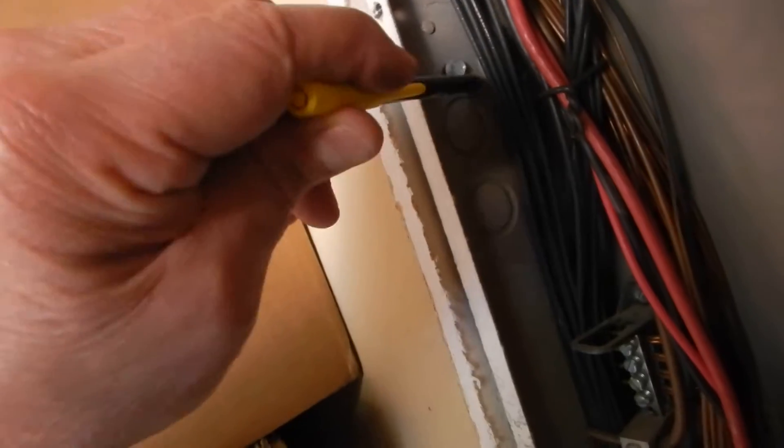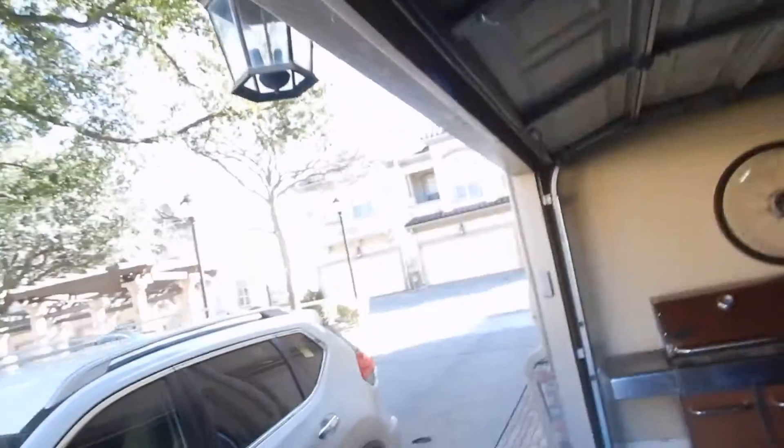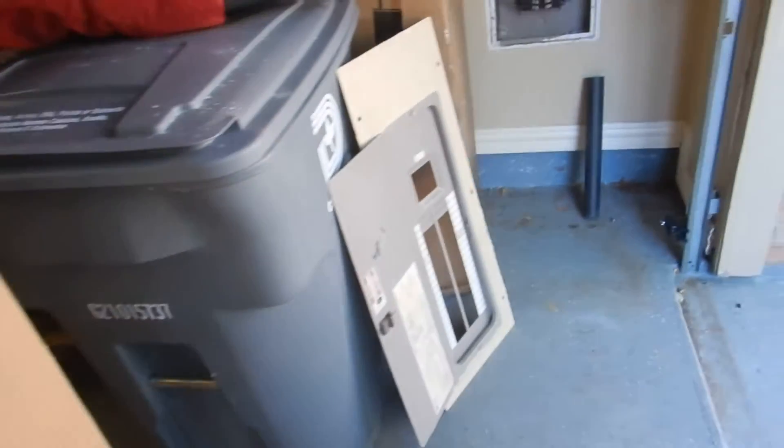The cabinet was screwed in. Screws are faster and tighter — I get that. But nails have much more shear strength. If this community experienced a tornado, your garage is already blown up — but if this cabinet had been nailed into place rather than screwed, it might still be attached to a framing member, maintaining some order for first responders.